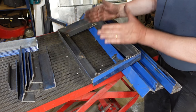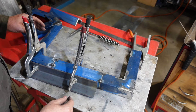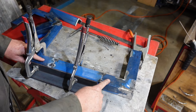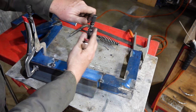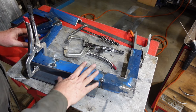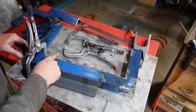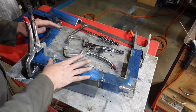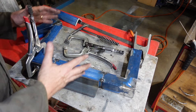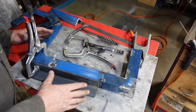I'm starting by extending the top. The way I've done that is I've cut it in the middle, marked both sides so I know which sides match, and then I've got a piece of material to go in the middle — in this case it's 220 millimetres long, which gives me the length I need. I'm using another piece of angle just as a straight back, so I'm tacking and then putting another tack on the inside after I've checked that it's flat. That's just so that if I blast it away everything doesn't try to suck up.